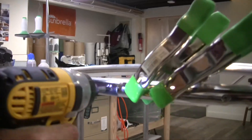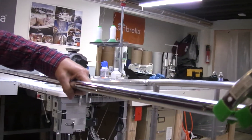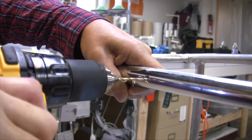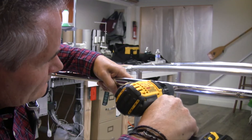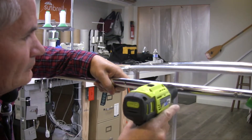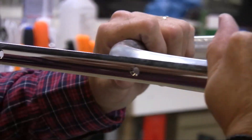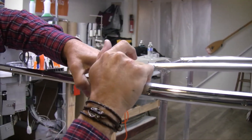When I first started doing this, I was hand tapping these things, so I got the nerve up to actually put a tap into a drill and do it. I think I broke more taps hand tapping than I did with a tap in the drill. I'm going to untie the bolt and shift it a little bit — working in the corner and just pull it around.